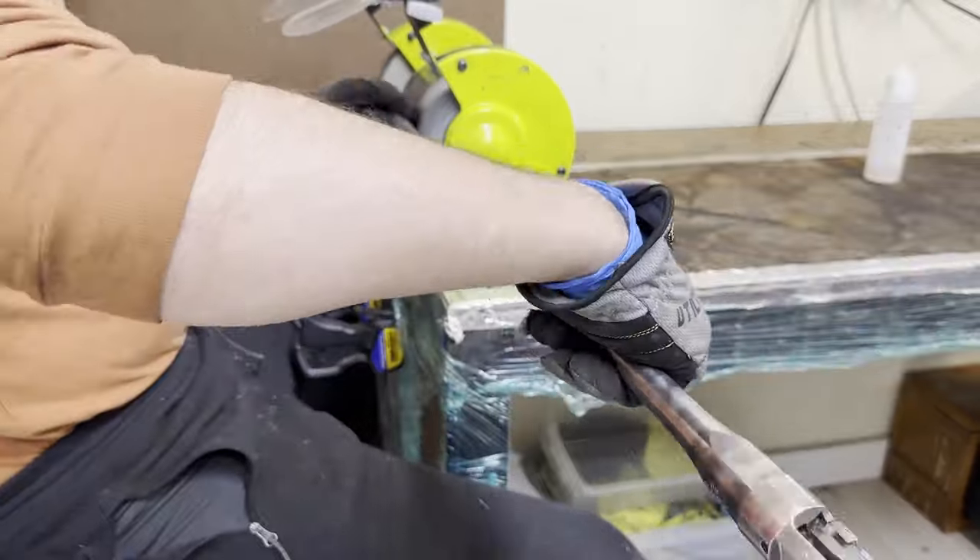With the sanding all done, it's now time to apply our pre-stain. This allows the stock to take on and absorb our stain more easily. I apply it with a small cleaning patch and let it sit for about 15 minutes. While that's drying, I go ahead and mix up my desired stain — I chose a mixture of Gunstock Sedona Red and Golden Peach. I wanted to get a nice orange color, and as you'll see, it came out pretty darn good. I apply with a cleaning patch like we did with the pre-stain and let it dry for about two hours before applying a protective matte coat.